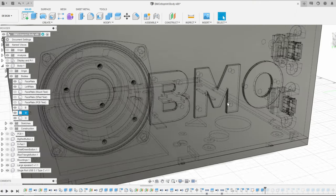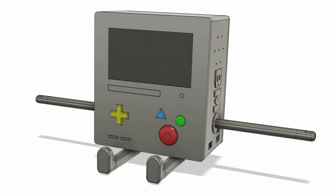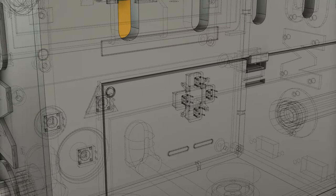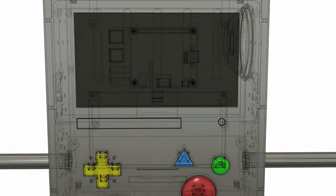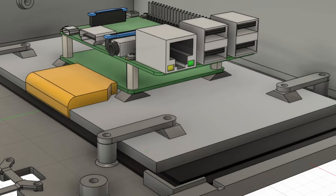Once the button mechanisms were squared away, I bit by bit built up the rest of BMO's body, which for the most part was quite simple and straightforward. In terms of general design and shape, BMO isn't terribly complex, but the beauty of this design isn't necessarily what you see on the surface — it's what's going on beneath it. Keeping the aforementioned rules in mind, I designed all the electronics mounts to not only take screws for easy installation and removal, but to print in an orientation that requires little to no supports. Additional mounting pieces have also been kept to a minimum, so there aren't a million tiny bits to print and keep track of. The specific print orientation was chosen for another good reason too, but I'll get to that shortly.